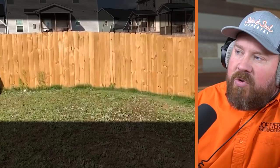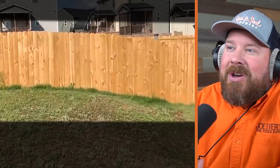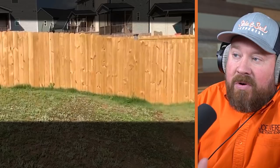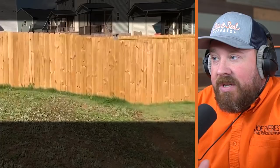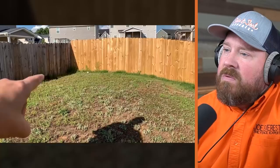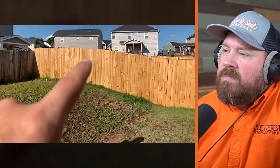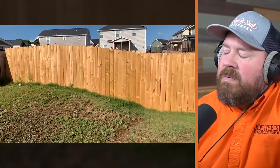Coming over here, this is the other way of handling contours: slope the fence or follow the terrain with your fence. Rather than a stair step — stepping down and then moving over — the fence we're looking at now was likely built on site. This is a contoured style rather than the stair-step style the other guys installed. This is professional. You have this hill right here that goes down and then comes up. The top of the fence follows the contour of the yard — that's how it's supposed to be, and that's what our HOA code calls for.